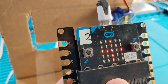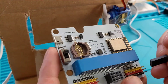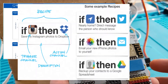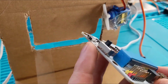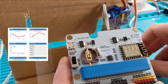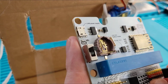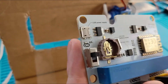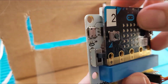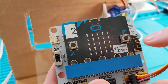This guy here is an IOT board, which is super cool because it can write straight to ThingSpeak, or IFTTT (If This Then That). You could have a website with a graph showing your servo's position really easily. It connects to Wi-Fi and graphs away — something you'd normally need a PC to do. I'm going to look for pin 13 here — watch out, it's not exactly at the edge, it's right there.